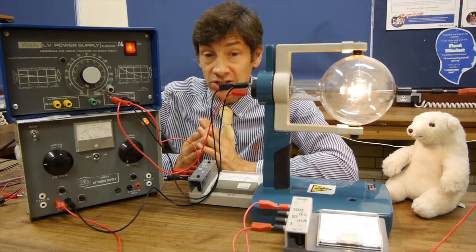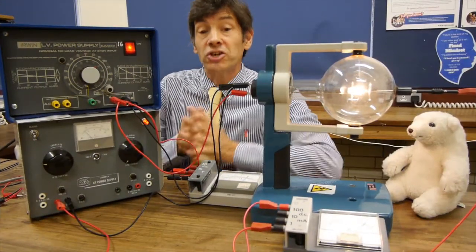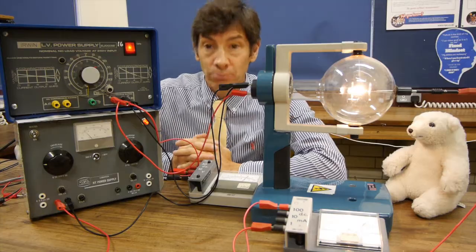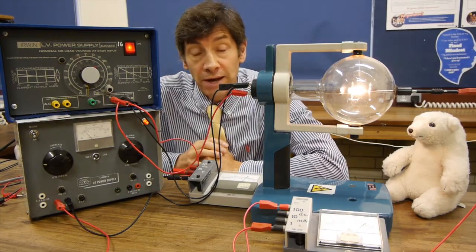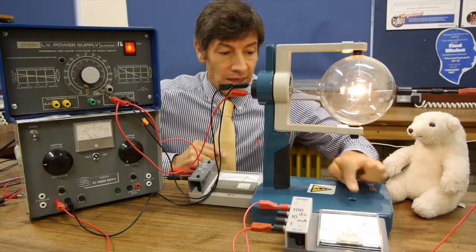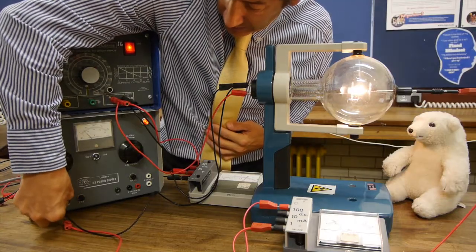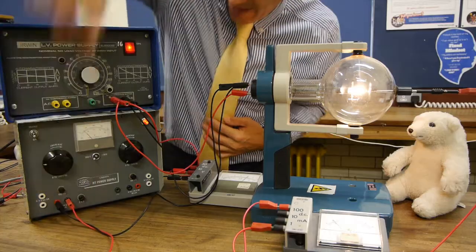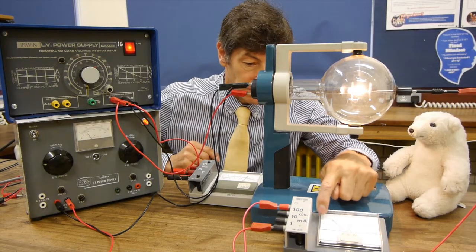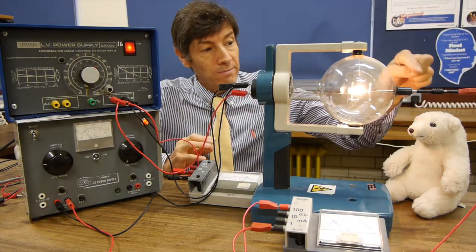What's really interesting is if we make the anode negative — so let's turn the tube around electrically. I'm going to make the anode negative and the cathode positive. The easiest way to do that is to disconnect the two terminals on the power supply and turn them around. I've left it all switched on so you can see I'm not cheating — it's the ammeter you need to watch. And now we've got a negative anode and a positive cathode. The zero on the ammeter is there — that's a negative reading. So we've got absolutely no current whatsoever through the tube if we make the anode negative, meaning no electrons are passing through the vacuum between the two plates.